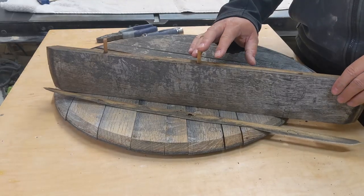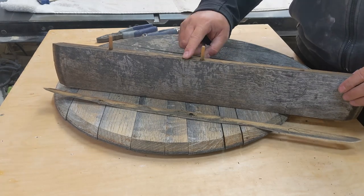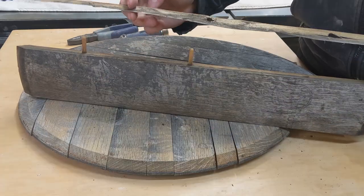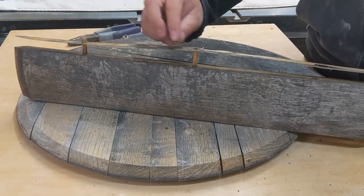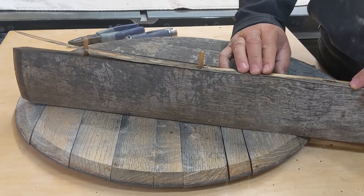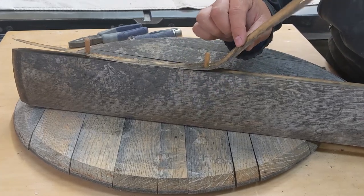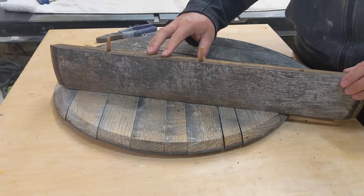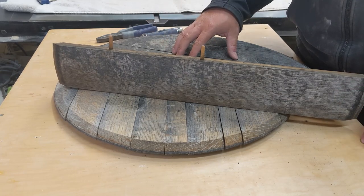I've lucked out a bit with the barrel tops I've chosen — they're held in place with dowels. I could try to squeeze glue between each piece and clamp it, but most barrel tops also have a reed in the middle which expands and contracts when the barrel is filled with liquid, making it waterproof. So I'd probably just be gluing to the reed without a positive connection. I'm going to use a different method that will also act as a french cleat to hang this on the wall.